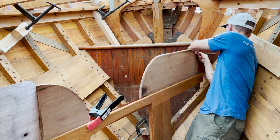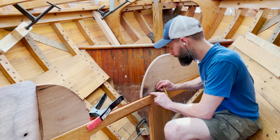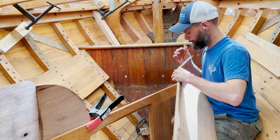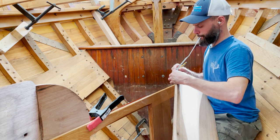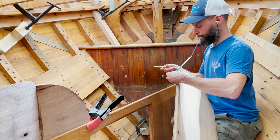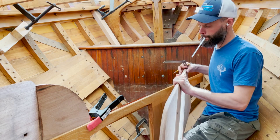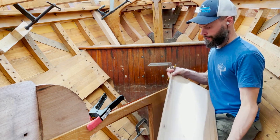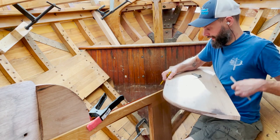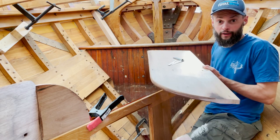Goes back 3/8. Okay, that is the angle and the distance. I'm going to nip 7/8 off at whatever degree that is. We'll see how we fit. Right now I'm aiming for about, I don't know, a 1/16 long, because we can trim just a little bit off the end. Better that than cut it too short.